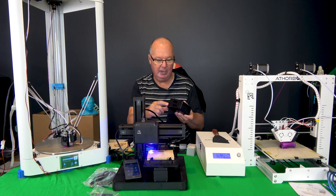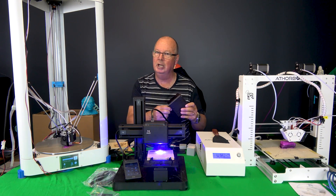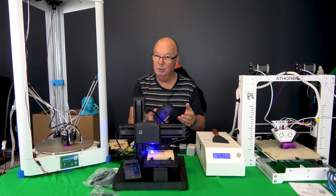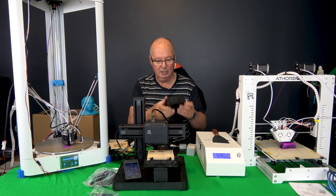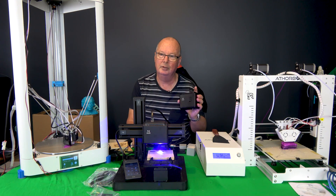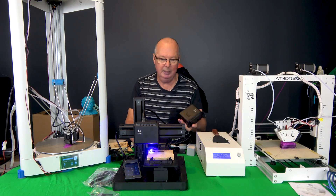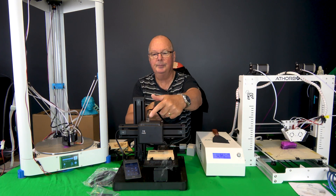When I got it working again, I found I had the heat block too close to the extruder, so I couldn't get heat into the nozzle — it was all dissipating. So I had to pull it apart again. Another two hours later, I put it all back together, dropped the nozzle and heat block down, got it all back together, and started printing again. Unfortunately I forgot to tighten the nozzle after heating it, and consequently I had a filament leak everywhere. It was horrible.